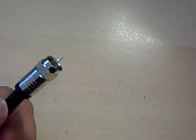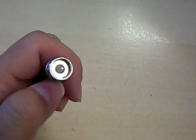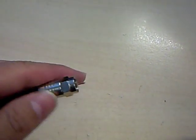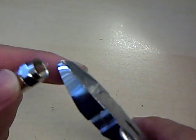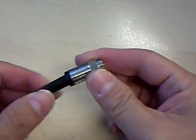And you should have a nice clean finished connector. It doesn't slip off, the jacket is well seated, and there is no braiding or foil interfering with the center wire or crossing over the dielectric onto the center wire. Keep the tip at about a quarter inch and snip off the excess. And there you have a nice clean finished F connector on your coaxial cable.